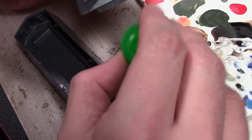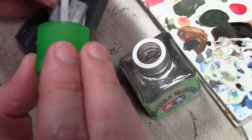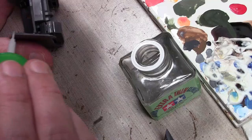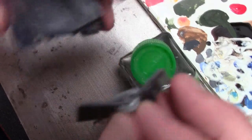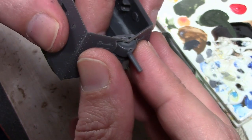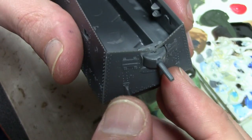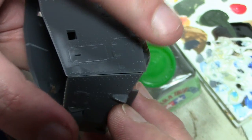One of the benefits of this product is it has a handy little brush already on it. There are two ways to apply it - don't use a whole bunch, dripping is bad. You can put a very small amount on each side of where it's going to go. It takes a few seconds to activate and start melting the plastic, and then you just press it together and hold it for about 30 seconds or so, depending on how much tension is on the piece.